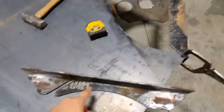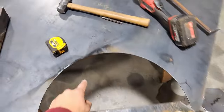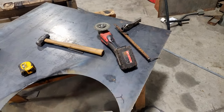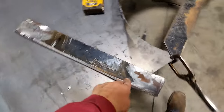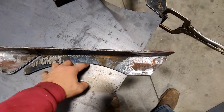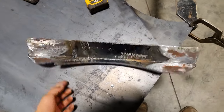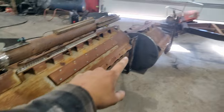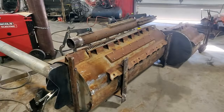Here's the setup for cutting the radius on my angles for the mounts. I got this jigged up with a center punch mark so I can put my Cosmo Cutter radius gauge in and blow that semicircle out. I have a slight problem — this circle needs to be higher because there's a rest bar mount in the back that comes down too far. I picked it off the trailer and laid it down to weld the angle feet on, then set it back on the trailer to check alignment.